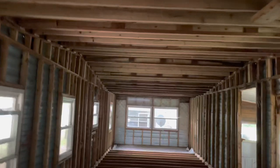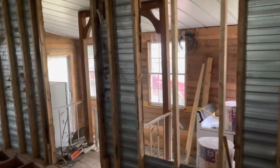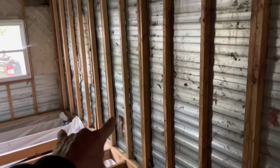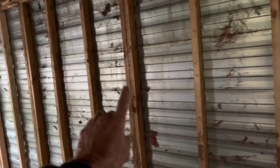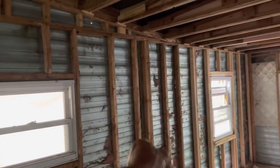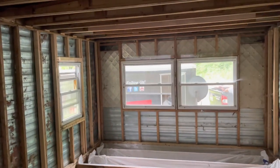That's what he's done throughout this whole place — that's the reason he could take out all these walls and not worry about his roof caving in. If anybody wants to know what their mobile home looks like underneath the interior, this is it. Some of them literally have 2x4 walls; this one has a 2x3 — about one and a half by two — wall, but they're every 16 inches and doubled up every other one, which is probably for their four-foot sheet panels. They double them so there's a double every four feet throughout the whole trailer from one end to the other, and they did the same thing on the other side for their interior paneling.